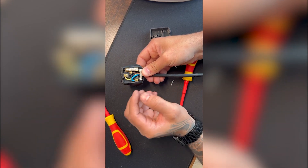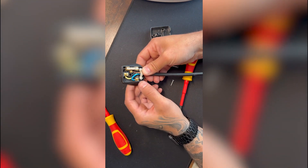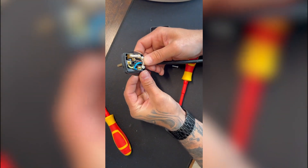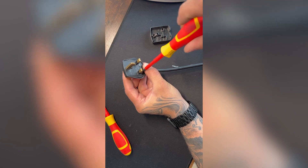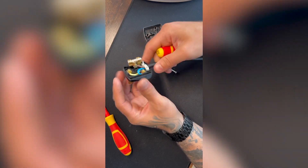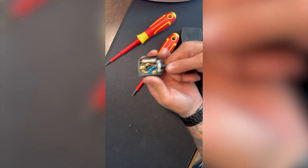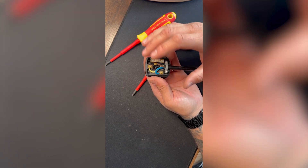Make sure these are all tight. You've got no copper hanging around in here — don't cut your sheaths back too far because it's obviously dangerous. Put the screws back in and start tightening the clamp down evenly, because it'll only pull to one side. Make sure you're clamped on this sheath here, as that's what's going to stop it getting pulled out. Tighten them down — your cable's now safe and secured inside.